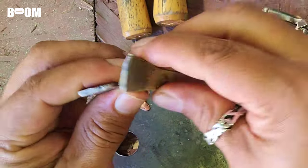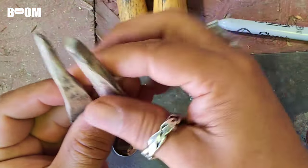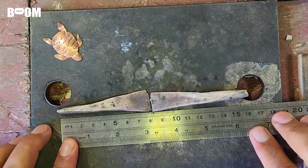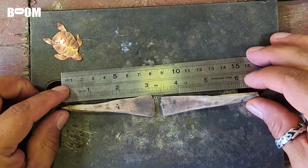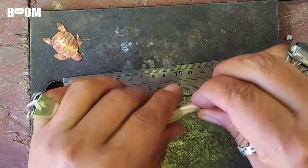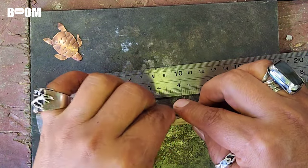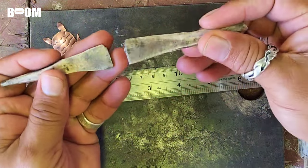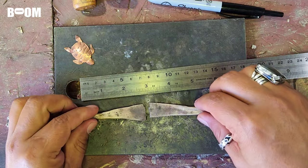I think it's possible, but all I have is a wooden bracelet mandrel. I think I need to thin this up a little bit before I do that, but there's more than one way to skin a cat. I don't want it any thinner than this, so I want thick here. This length is just under seven inches, and a typical lady's wrist is about six to six and a half inches — I don't want it to fit too tight. I might drill a hole and put a piece of wire that I rolled myself; I want this all to be handmade from the ingot. I don't want to use sheet or wire bought from Rio — I want to do everything old school.